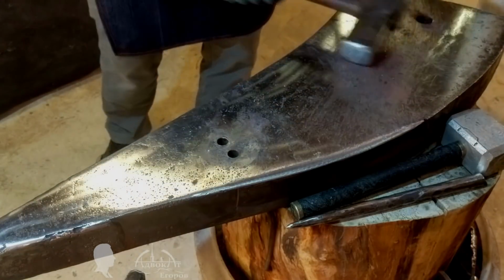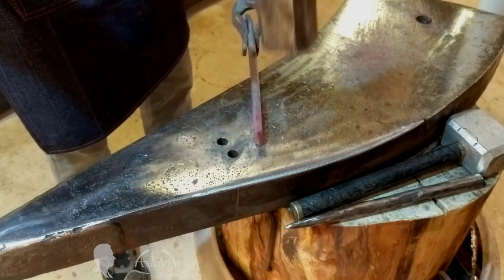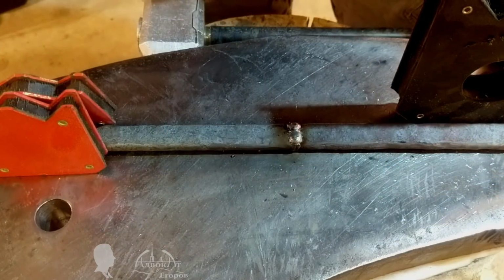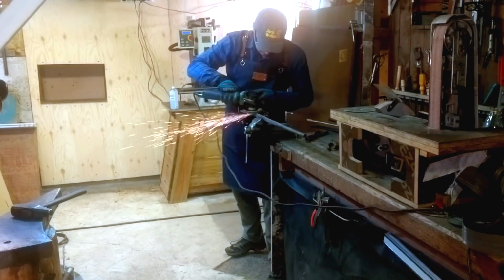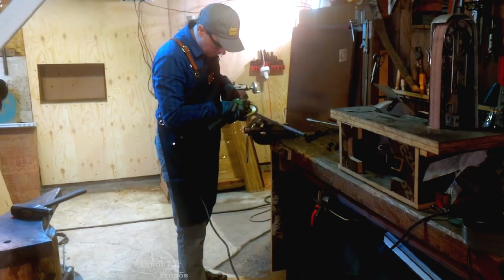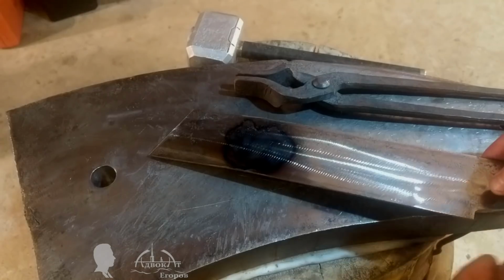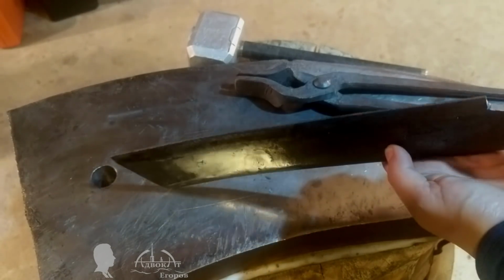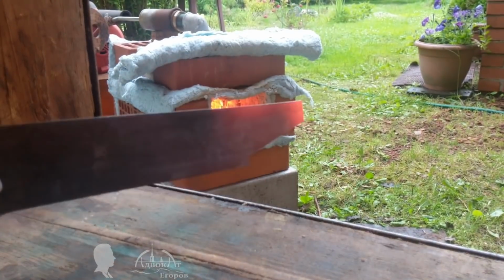The handle part that I attached to the blade and then to the mounting hole could now be welded together, after which all of the bumps and irregularities formed during forging and welding can be ground off. Because there was a small defect on the blade's portion of the metal strip, I simply added some material with a welder there, which predictably curved the metal strip, and I had to flatten it on the anvil. The handle portion of the knife's spine should be slightly humped.